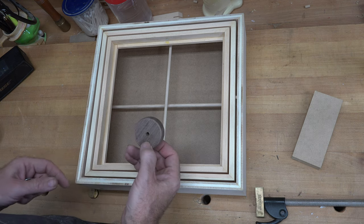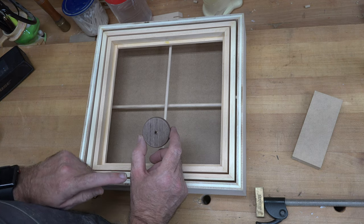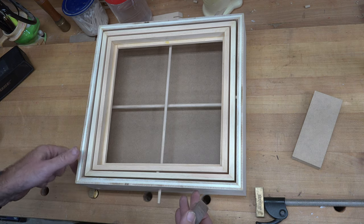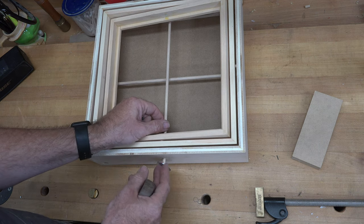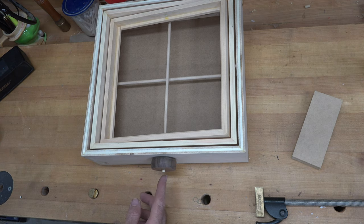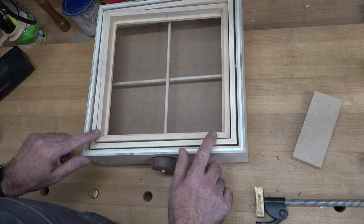For the knobs of this labyrinth game, I've taken some scrap three quarter inch walnut, used a two and a quarter inch hole saw, and cut out these knobs, then sanded them so they're a little rounded just to make them look a bit better. On each one of these dowels, I'm going to place a quarter inch flat fender washer and then glue our knobs loosely onto our quarter inch dowels and let them cure. Once they're done, flush cut this dowel off and sand it completely flush — that'll give us our turning mechanisms for our platforms.